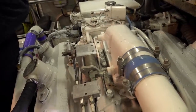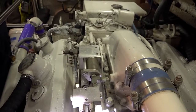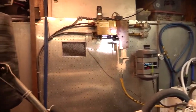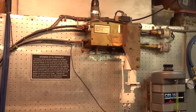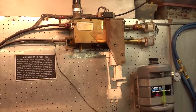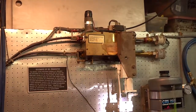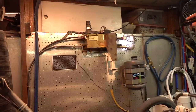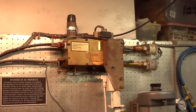This is the Hi-Nautic controls — it controls your throttle. Both of these things are part of the Hi-Nautic system, and that system is connected to the Glendinning over here. When you turn on the Glendinning, this engine is the slave — you turn on the Glendinning and push the port throttle ahead, and the starboard then becomes your throttle for both engines. The Glendinning is the synchronizer system; it synchronizes both engines together. When you push up the starboard throttle, the Glendinning tells the port engine to catch up to the starboard, and when it catches up, it stays there.